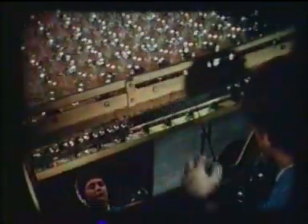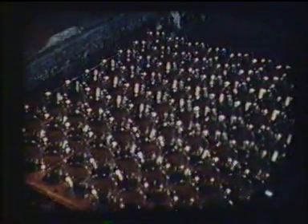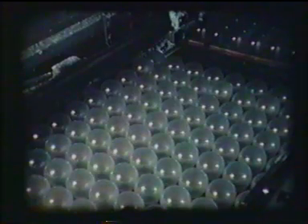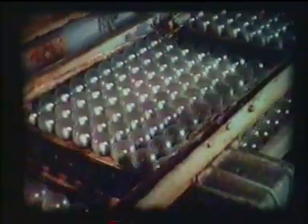From here, the trays move on past a further visual inspection point and into the frosting process. The trays traverse over a series of tanks, each fitted with jets and holding various solutions. The first tank contains a hydrofluoric acid mixture which etches the surface of the bulb. The second and third contain diluted acids which even out the roughened surface, thus strengthening the bulb. The fourth and fifth contain hot water in order to wash away all traces of fluorine, and the sixth, seventh and eighth tanks contain hot air for drying purposes.